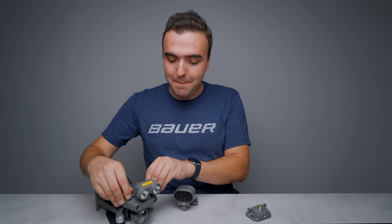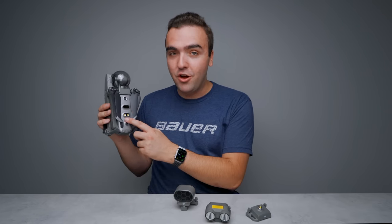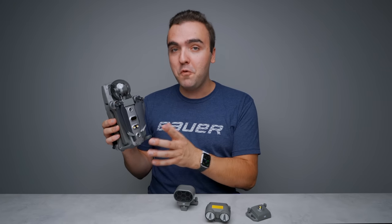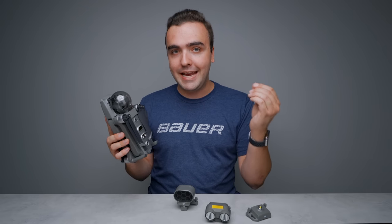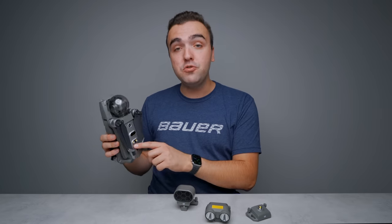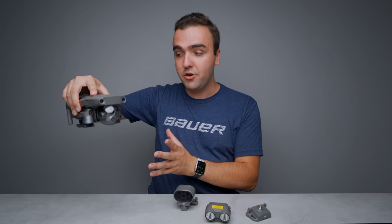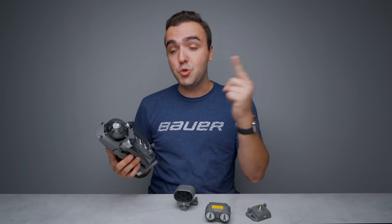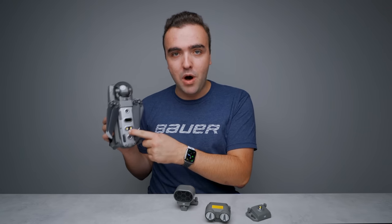Here's my gripe though about the light beacon, is that the Mavic 2 Enterprise Advanced airframe already has an auxiliary LED built into the bottom that can be used to see the drone from over 3 miles away when you're flying in low light scenarios. Now, the main use case of this auxiliary LED is to be used when the drone is landing in low light scenarios, so it can throw light onto the ground and it can come to a nice slow landing if the area is dark. That's great, but it has a dual purpose of also being spotted while flying around.